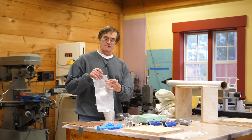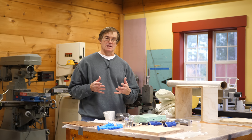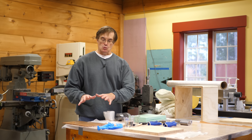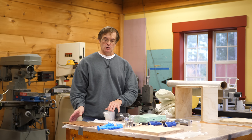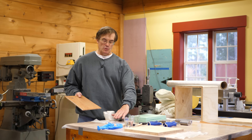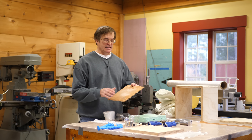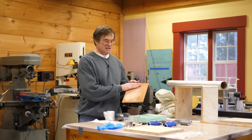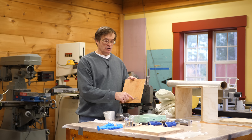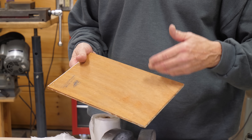Because the fiberglass has a finite thickness, when loaded with epoxy, you've gotten the same total thickness as maybe 7 to 12 layers of varnish. This means it's going to be much more resistant to water intrusion, chemically resistant, as well as harder. It's going to add a little bit of strength, but primarily we're making a hard surface. If I coat this sufficiently that all of the weave pattern is filled up and this is glassy smooth, I have what's called a bright finish in boat building — that simply means I can see the grain pattern through here. You can still read through here, so it works very effectively in producing a hard surface that's still a very attractive surface.